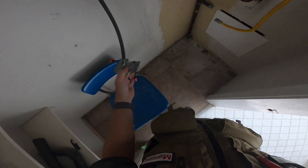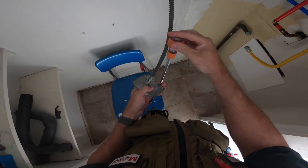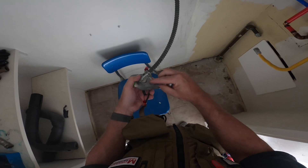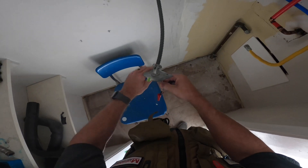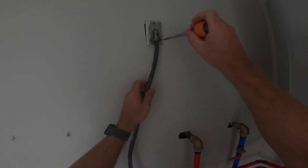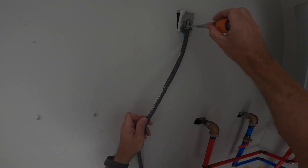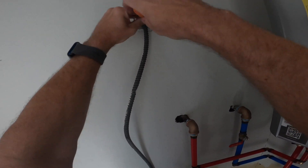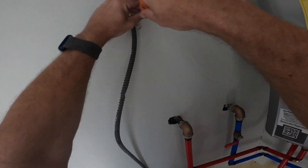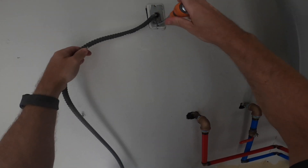Now I'm checking out the existing wiring. I figured I would have two hots and a neutral or ground — either way you want to call it — going back to the main panel, not from a sub panel, so it's really the same thing. Now I'm going to get inside the box the whip is coming out of so I can see if the wires inside match what's actually in this whip. I actually have to remove the whip to access the screw to get the cover off as well.